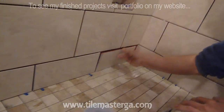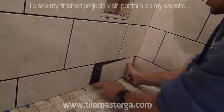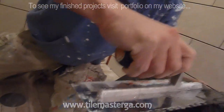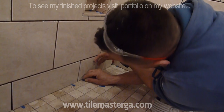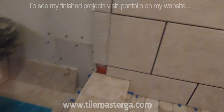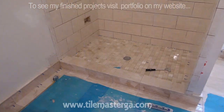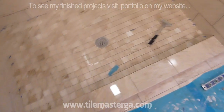And as you can see, we have a pretty decent piece on the bottom, and I was able to have almost a full piece on the top to the ceiling. This way it looks the nicest, the cleanest, and is durable, because the tile actually holds with a larger surface instead of just a little bit. So yeah, this is it. Last two pieces to put over here. Here, this corner, and the corner over there. And those bullnose pieces over there. So we have all the tiles in place. All the pieces already nicely installed in our shower. And I'm slowly moving forward with preparation for grouting.